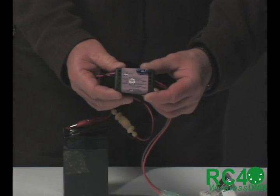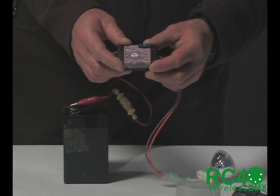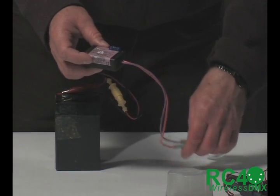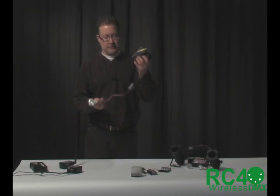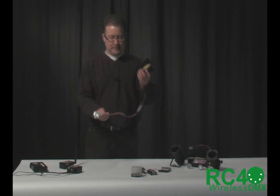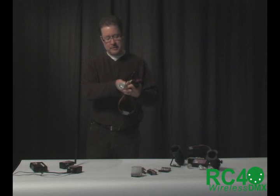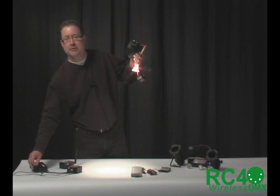Here's our simple little two-channel receiver dimmer, so there are two channels of dimming. Each dimmer can be assigned to its own DMX channel, and I'm showing it here in the simplest configuration of a battery for power, one channel connected to an MR16. This is the power flow really in using any RC4 Magic dimmer — find the power source that's appropriate for the load. In this case, you've got a 12-volt battery and a 12-volt lamp. Put the dimmer in the middle, assign it to a DMX channel, and now from a DMX console, live in real time, I can control that light just like any other light in my rig.